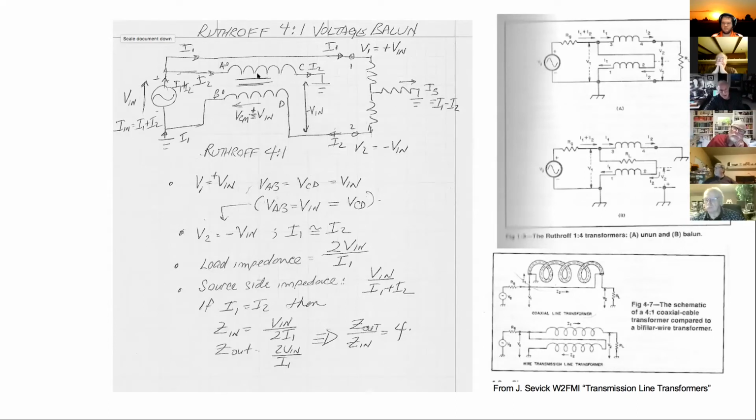Okay, if there's common mode current, then you're going to get, at very low frequencies, magnetic coupling between this side and this side, and then you're going to get an imbalance, because the common mode current will cause an imbalance from one coil to the other coil, like I explained very early on in the talk. You're not going to get the same effect anymore. You're going to basically just induce current from one side to the other, and you will not suppress the common mode current.